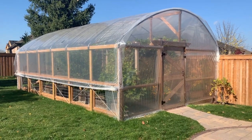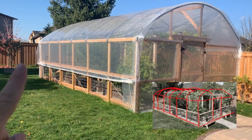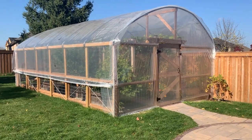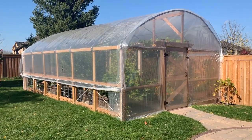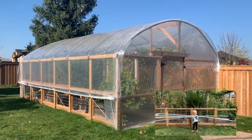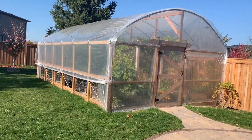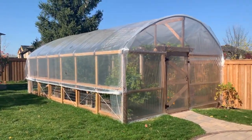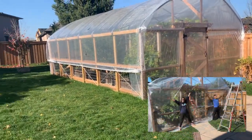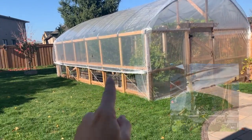For the cold frame itself, I elevated the outside walls to go from three feet to six feet so it matches the fence, and then I was able to put that framing there and put the seven PVC arches across the top. For snow load I also put in a beam through the center, then wrapped it in poly. There are three pieces of poly — one for the front wall, one for the back wall, and one that goes right across the top and down the sidewall.